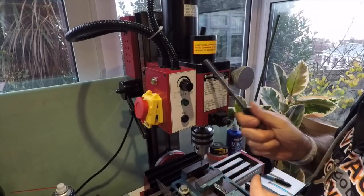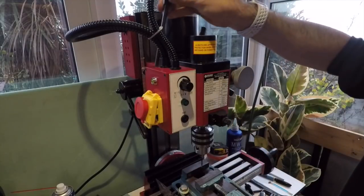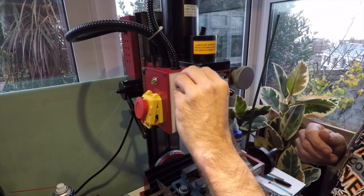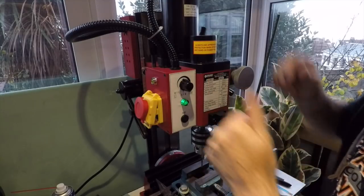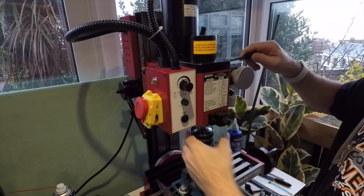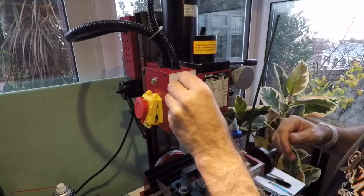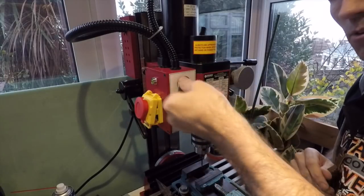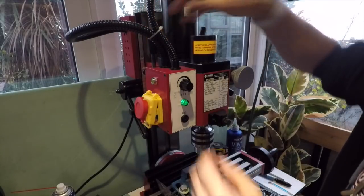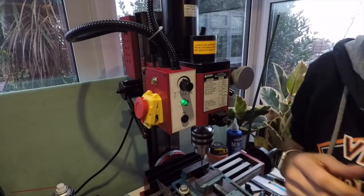This is powered up now and nothing's happening. It's dead, which is just what I want. So if I put this bar now into there, powers up. Brilliant. Take that out, the light goes out, and it doesn't work. So now I can change the chuck for the collets and not be in any danger of having the machine actually working. It's dead until I put that back in there. Brilliant. Now I can carry on